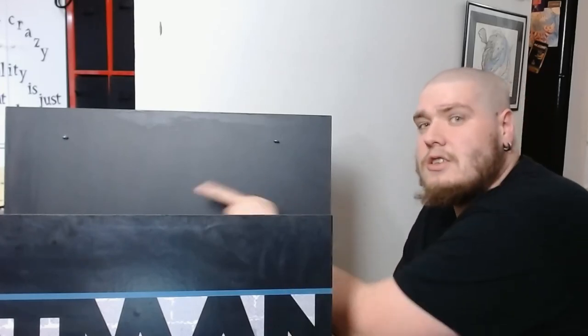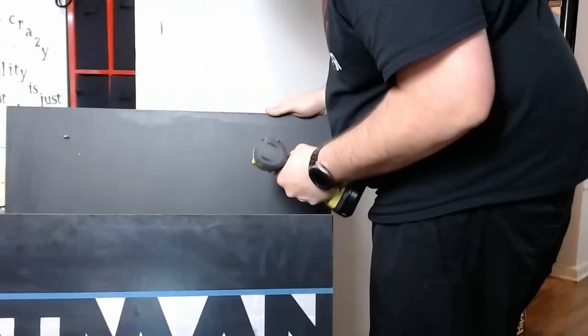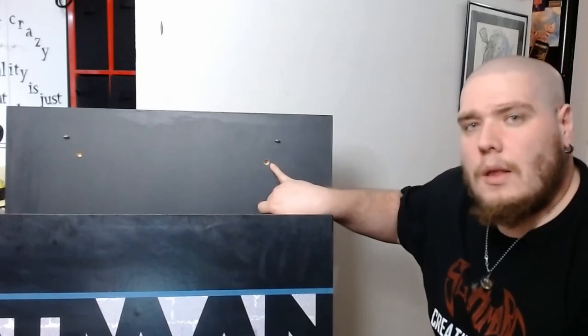The studs in our wall are 16 inches apart, which means I want to measure in 6 inches from both sides so I know exactly where to put our screws. I'm going to drill my pilot holes with a 7/16-inch paddle bit. That way we don't mess up the MDF while screwing into it, and I also drill a little bit farther so the screw sits flush and doesn't prevent the piece from sitting flush against the wall. I'm going to go ahead and make sure I have my level, because I want to make sure this part is going to be level when mounted.